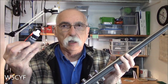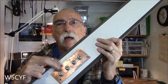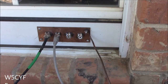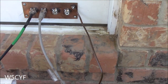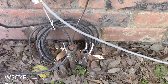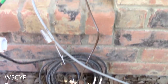You can buy this at Lowe's — it just helps prevent some of the oxidation along the outside. This PC board here has been outside now for two years and it's working just fine. Here's the completed job from the outside. You can see where the ground is off to the right-hand side of the screen, and the ground runs down to a ground rod that goes into the ground, and from there it goes over to the electrical ground so everything has a common ground on the house.